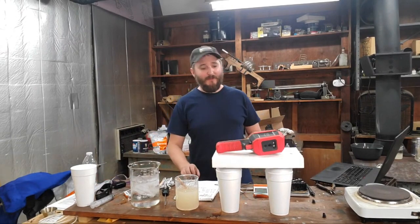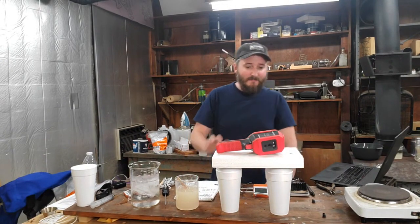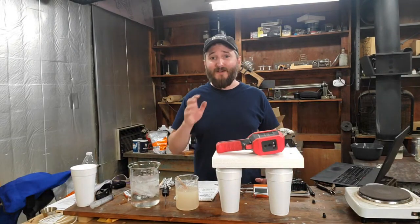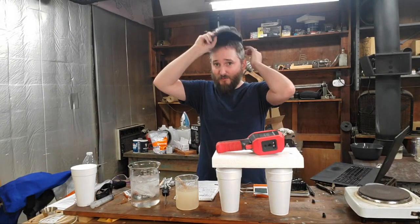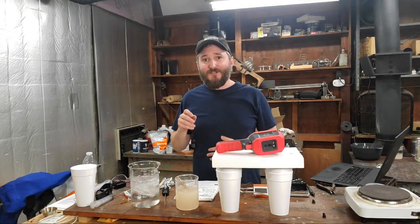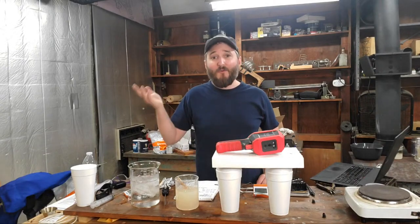I've been thinking about styrofoam a little bit as far as radiative cooling goes, because styrofoam is actually a very white material because of a snow scattering effect, which is the same effect I took advantage of in my radiative cooling paint, making acrylic have tiny little air bubbles in it, which makes it extremely white, an ultra white coating. And styrofoam is basically already that.